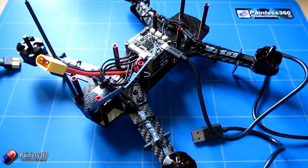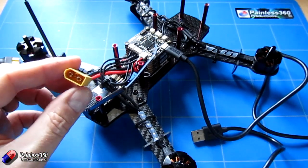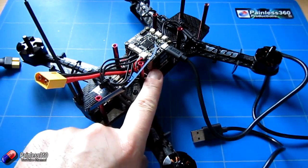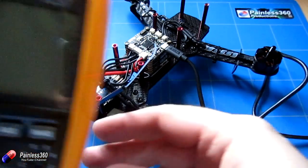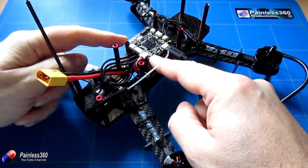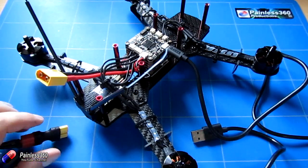Now I've created a quick model and bound the receiver to the radio, so I'm ready to test the SBUS connection. It's also time to power everything up using the flight battery for the very first time. I'd strongly recommend that since the ESCs are going to be powered up, make sure your motors are plugged in. For a last check before plugging in, get your multimeter, set it to the ohm/resistance setting, put the probes on opposite corners, and make sure there isn't a short in your power system.